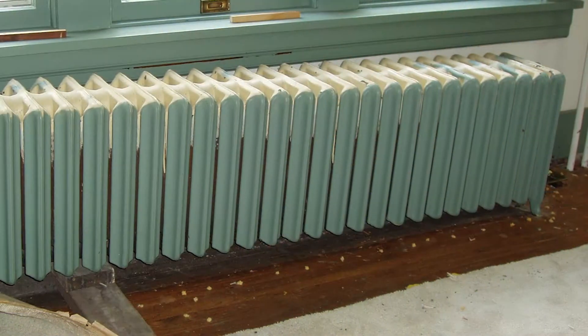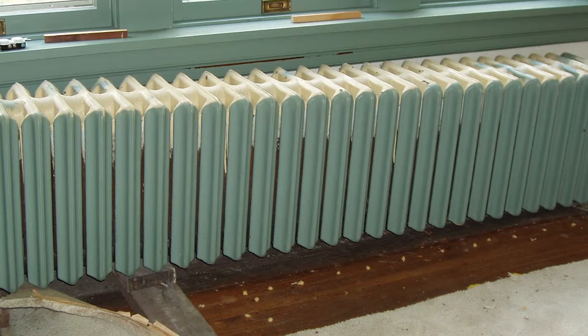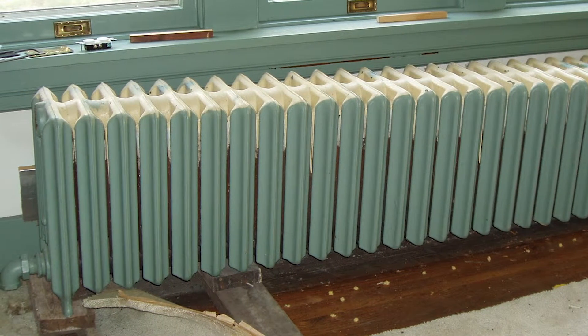Say you have a retrofit system inside an 80-year-old Victorian home with four different cast iron radiators, each heating its own zone. Old radiators consistently have a surplus of sediment and sand sitting at the bottom of their blocks — that's where the water flows — and to make matters worse, their blocks are very narrow. When the water moves through these blocks, stacked five per coil, it carries more and more sediment until over time that sediment builds up and eventually you plug a coil. Once you plug a coil, that's all she wrote for that radiator. You don't want to plug a coil.